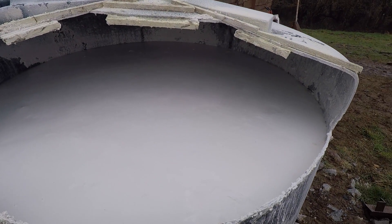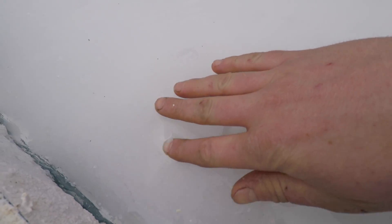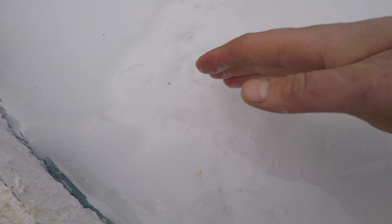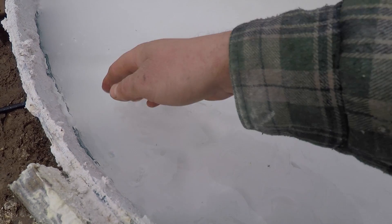Okay, let this settle down now — that's about as much as I can fit in it, it's pretty well filled up. Might get another bag in there if it settles down a bit more. You can see the lime under there — it forms this crust, which is quite strange. You can see the whole thing kind of moving there. I'm going to get a bit more water over this so it's got more protection from carbon dioxide. There's the putty.